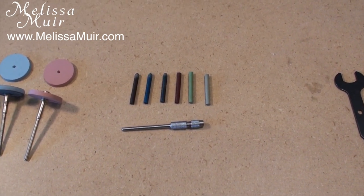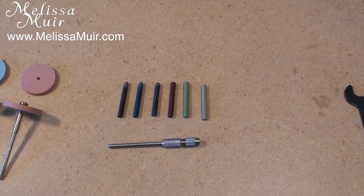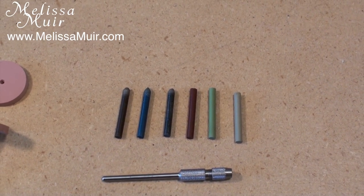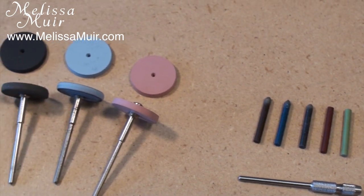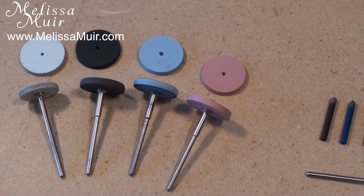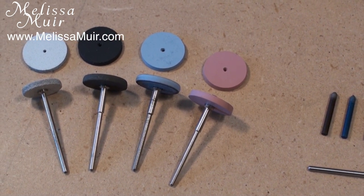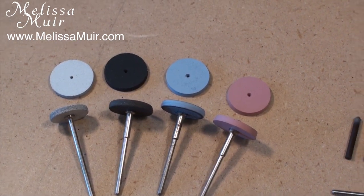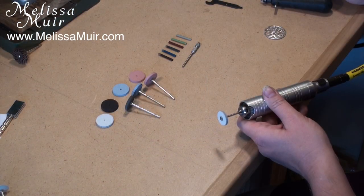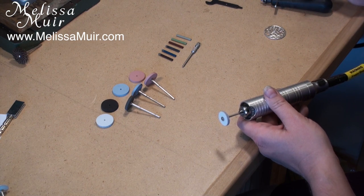On a few of these pins I've already sharpened the tips, which allows me to get into some of the finer areas. All of these different wheels and pins can be resurfaced or reshaped with just a normal file. I'll show you the polishing wheels first and then do some of the finer detail work with the polishing pins. One thing to note: anytime you use these, make sure you have good eye protection and a good dust mask. I also highly recommend wearing an apron so that when particles from the wheels go flying, you're not wearing them.